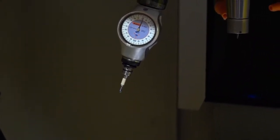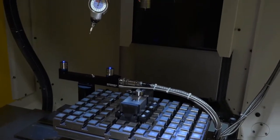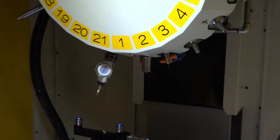To drill a hole half a mil diameter 50 times D, we do it in successive stages. So we'll spot drill, we'll drill to maybe 5 times D, and then we'll go in with a slightly deeper drill to drill it to 50 D.